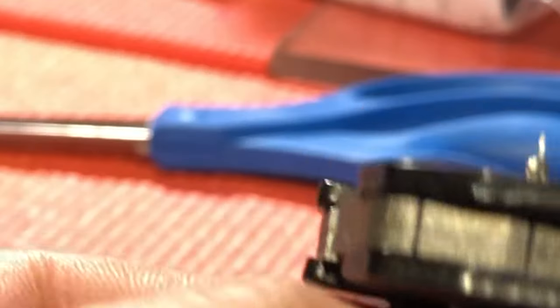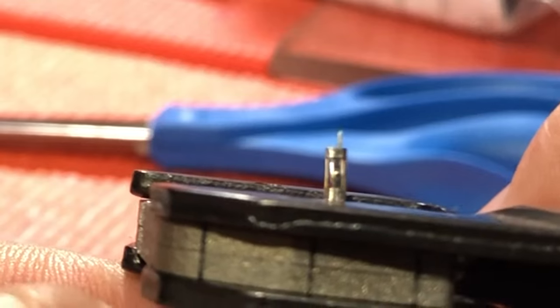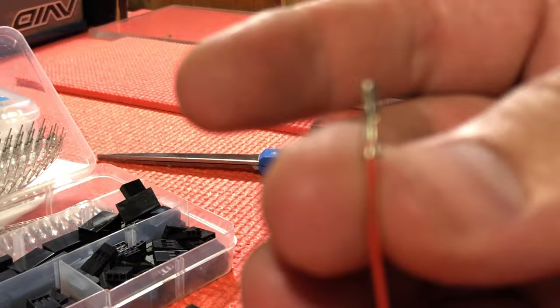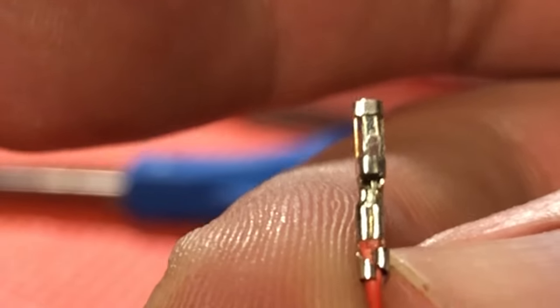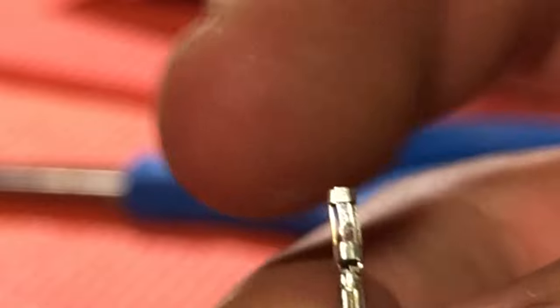Stick it in. Now if you look at the other side, you don't want to see the wire sticking out, so back it out to about there. Now take a close look — the red wire is crimped in on the first level, the wire itself is crimped on the second level, and that third section right there is undamaged. That is how you crimp it.